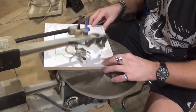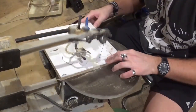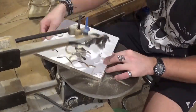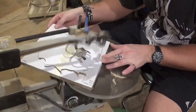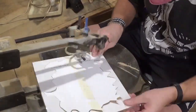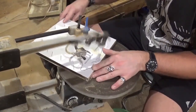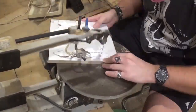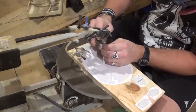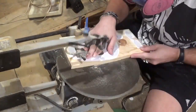This is the backer piece made out of pallet wood. Really thought it would give the project some great detail. I am using number 5 reverse tooth sharp tooth scroll saw blades, and I'm using those blades for the whole cutting process. And with cutting pallet wood, I highly encourage you to wear a dust respirator. You can see it there partially up in the corner when I lean over some.